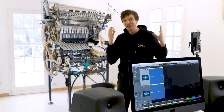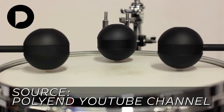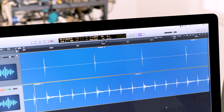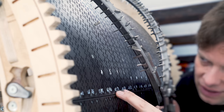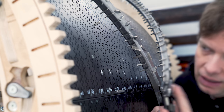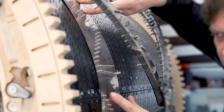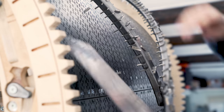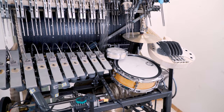What a difference this motor has made for the entire Marble Machine X project. Maybe the Marble Machine X can become the tightest mechanical musical instrument ever made. I noticed a pattern in all the tests - the first one was always a little bit more late than the others. I'm guessing the first one is so close to the edge and didn't really get the edge down properly. So I'm going to shift the whole program over to get away from this edge. Shifting the program away from the edge did help - the four hits were now consistent and I nailed the timing for kick drum test E.